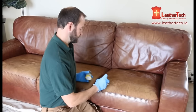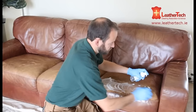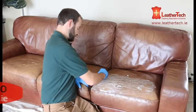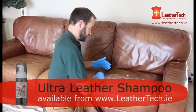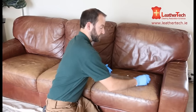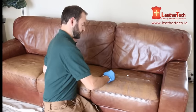Spray on your pump foam cleaner to get it going. As you can see, you need to use very little of the product on the leather surface — it's quite a strong product. This process just takes a few minutes, agitating it in a circular motion. I'm using no pressure here on the brush; it's merely just to get the product in. Now the top surface on this leather couch is very badly damaged, so some of it's going to come off in the cleaning. That means all the loose leather pigment on top is going to be removed, giving me a good surface to work with when I'm recolouring the couch.